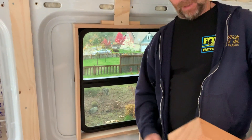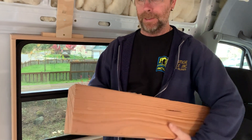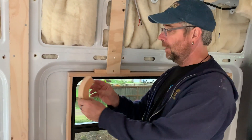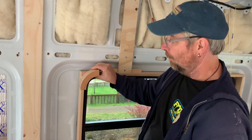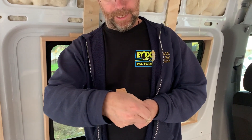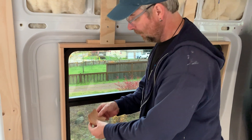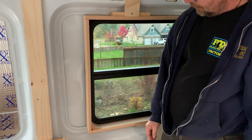For the corners, my brother picked up this piece of three by six hemlock — a real nice piece of scrap, just a foot longer than this. He got a good price on it because it was a cut-off, and he cut these corner pieces out of it. Originally these pieces of hemlock would stop right here and we would put a corner piece in place, but that ended up being kind of difficult to figure out exactly where to cut. So instead, we took the pieces he had already made and cut them at a 90 degree angle right here, and we came up with these.